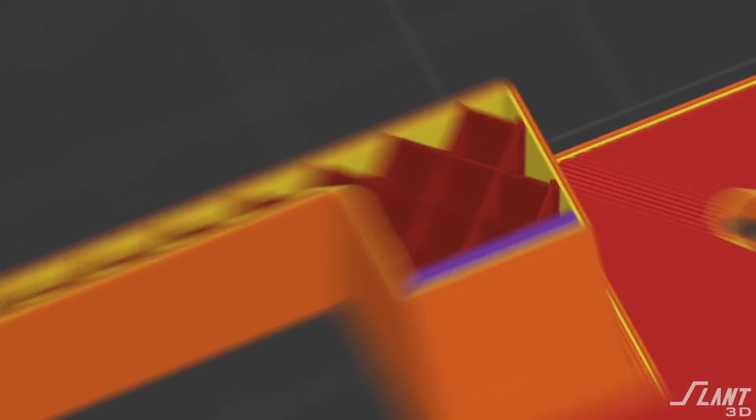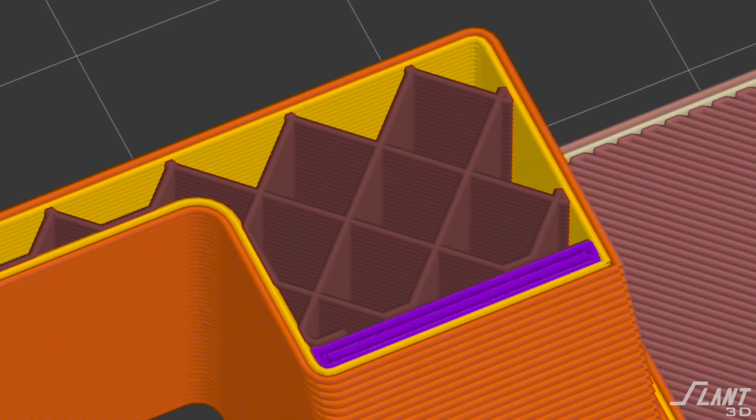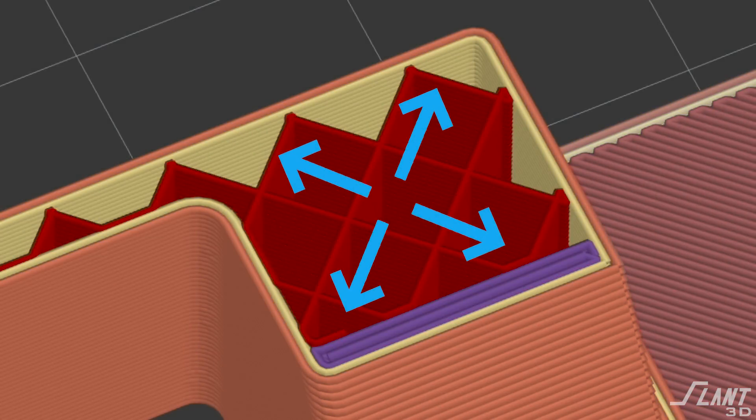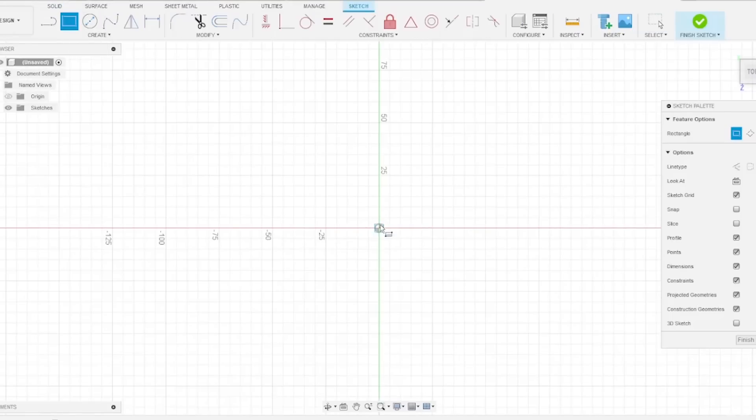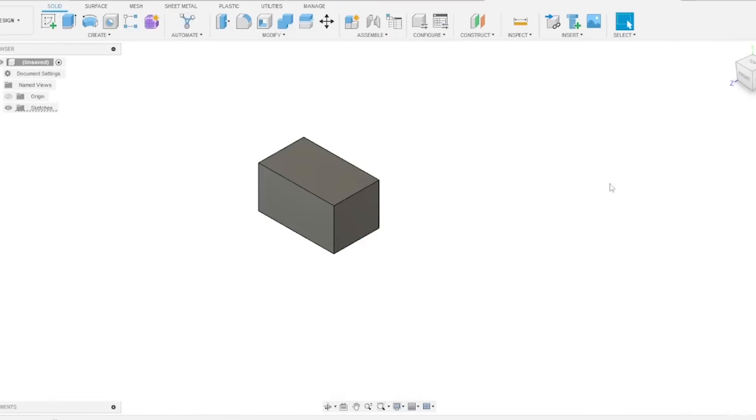Since printing doesn't have a problem with thick areas, this does not increase the cost of the part, because it's effectively hollow. Those thick areas serve as I-beams — the outer skin provides the strength and the inner part moves the moment of inertia outward. But this approach is not ideal, because it's forcing an injection-molded design to work inside 3D printing. If you actually want a 3D-printing-optimized part, you start with a brick and go backwards. Molding is about adding small thin features together, but printing is about removing the features you want and cutting them out of a block.